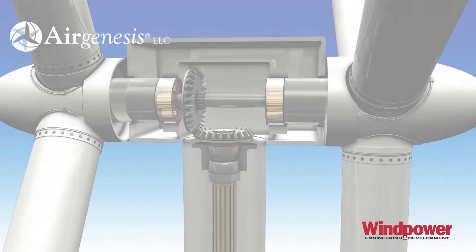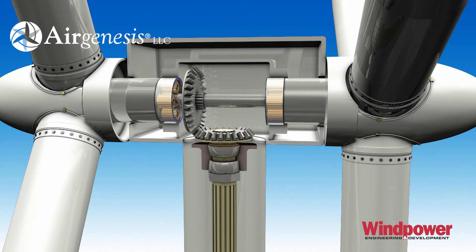A large right-angle drive sends torque down the tower by a large shaft to drive several generators at the base. The design calls for 12 generators: two 500 kilowatt units, and 10 each rated at one megawatt. The smaller ones let the turbine begin generating power in barely productive three meter per second winds. At rated speed, the design would produce up to 11 megawatts, though the company says flow simulations predict it could produce more.